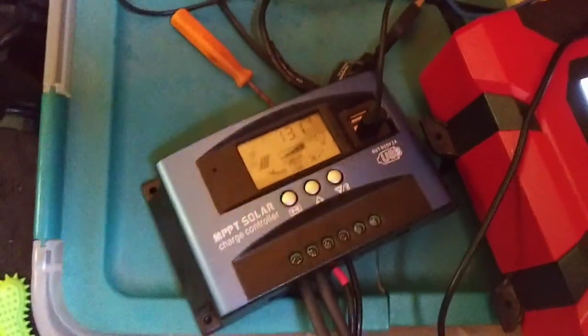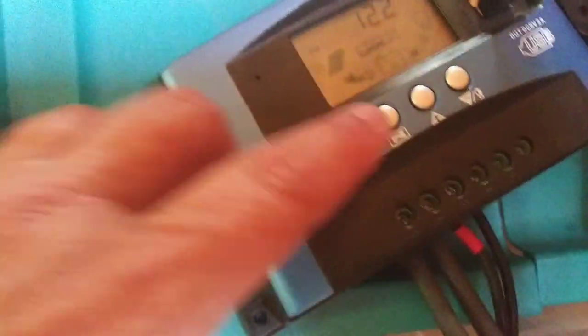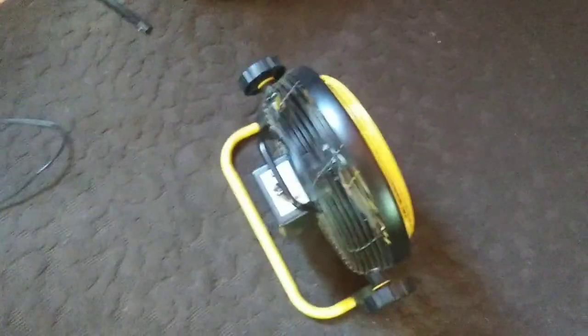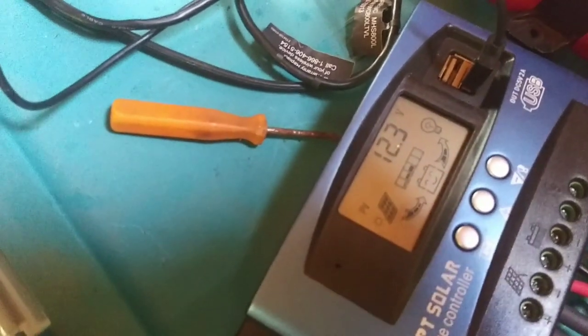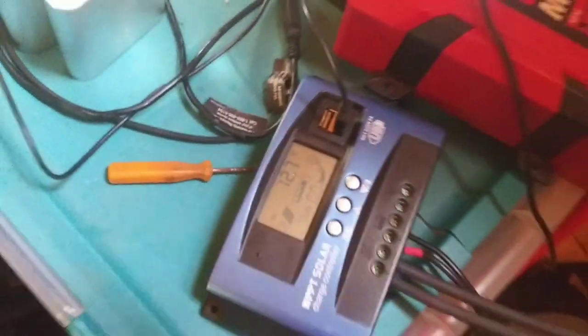Okay, this has been running all day — it's about 3 p.m. right now and we're still at 12.2, which is okay. We're only getting 1.4 amps in because the sun has come over the trees. I've also been charging things, running a fan over here and another fan over there, plus the refrigerator. If I end the day with at least 12.2 or 12.3, I think it'll go overnight just fine and we're gonna be okay with the refrigerator situation.